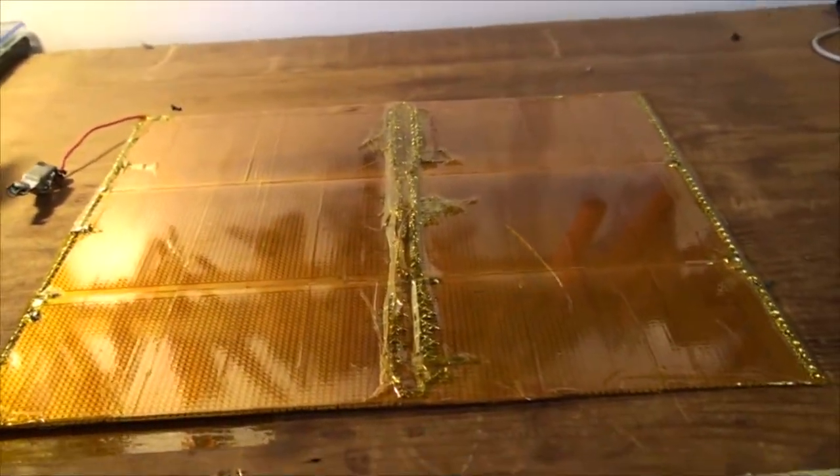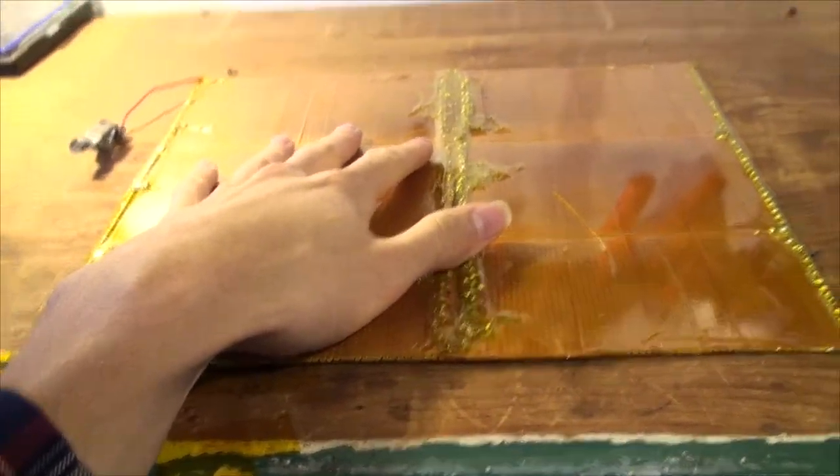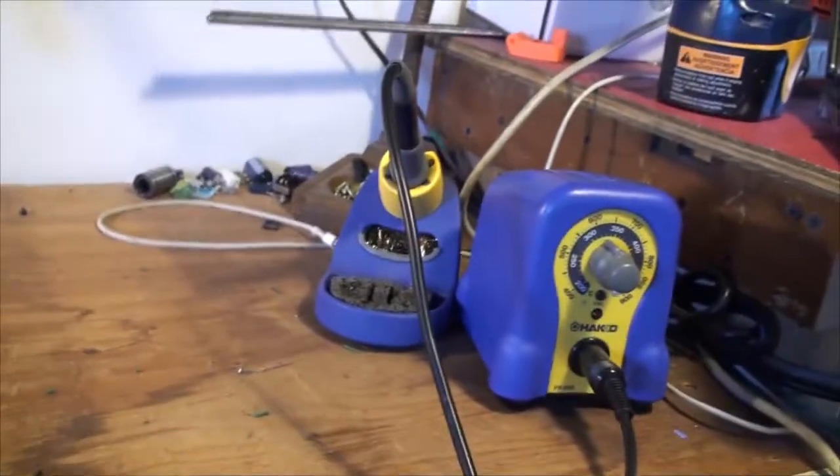And the next step is to find a good layer between the heater element and the glass bed plate, because you don't necessarily want the heater element to be in direct contact with the bed plate. So here's my bed plate, and I'll show you why. A, uneven heating would cause the glass to break, possibly, and B, there's a gap between the plate and the heater anyway, caused by the leads here from the staples and the copper wires.